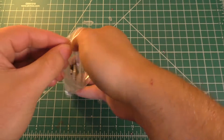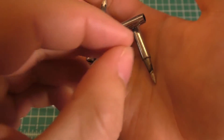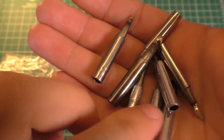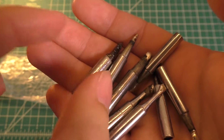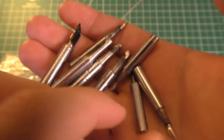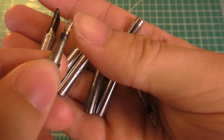I have not managed to completely wear out any one of these tips. One of my most used ones is probably this real fat chisel tip. All of these tips should have a nice coating of solder on them still because I always tin them before I put them away. A lot of the black marks you're seeing is flux residue, not bad spots in the tips. This tip I've heavily used for carving plastic — that's why it looks bad — but most are still in pretty good shape in terms of plating.